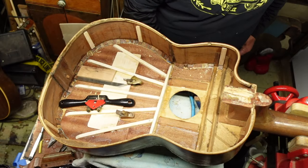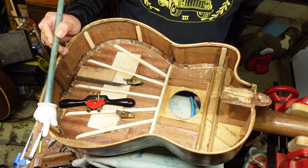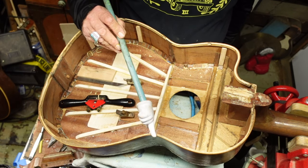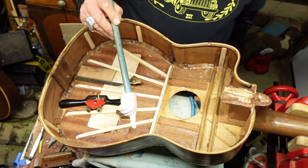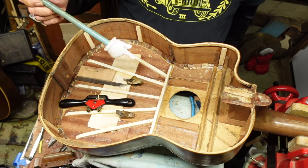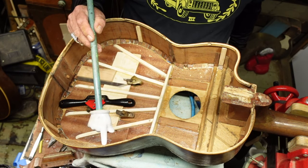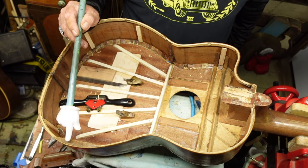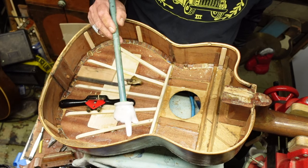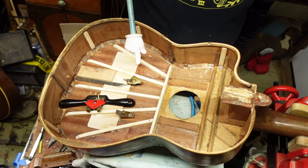Okay, let's start here. There is a piece of the old back right here, and what was done is the sides were left to extend up to here. There was a piece of furring strip set just below the top of the edge. You can see it over here, I think. And what that did was it was calculated what the thickness of that was, and that would match the thickness of the back. Now the back had some braces and there were notches cut in the furring strip right there for that that would come over here.